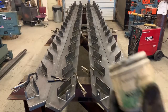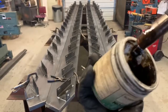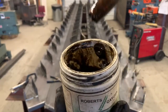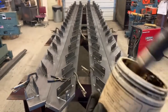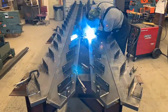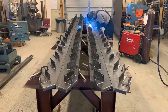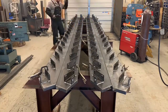All the clips are tacked up. This here is nozzle dip — I always do this, usually once per set. You can see it's dripping there. The reason is I'll run a couple of beads first to get the nozzle and everything good and hot, so it just drips off nicely. Then I run the wire out and clip it just a little bit. I've sped all this up — I want you to get a couple of good shots of the welding.